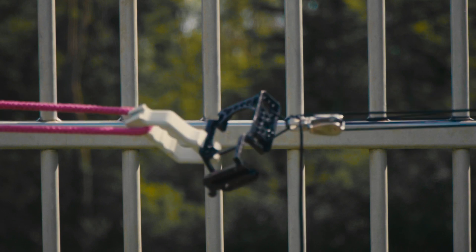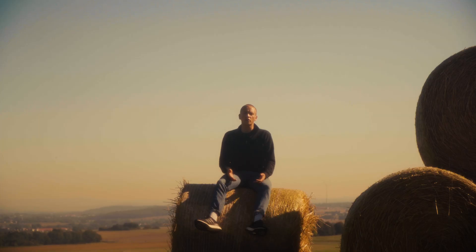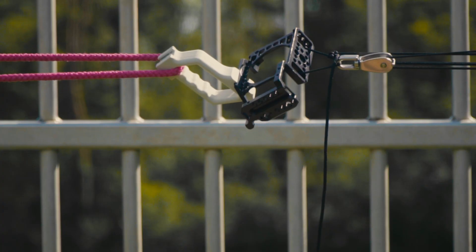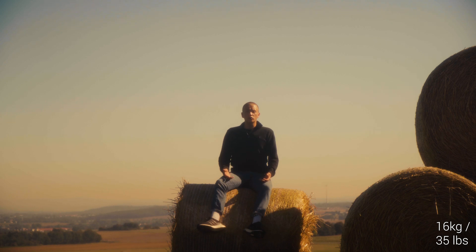So let's get to testing. I set up a pulley system and used a luggage scale to measure the force at which I was pulling. Thanks to the pulley system my pulling force was quadrupled. I started with the cheap top handle so I could work my way up. I applied the force at the biggest lever and therefore the most fragile part of the top handle. The connection between the cage and the top handle broke at 16kg of force. The top handle itself seemed to be fully intact.